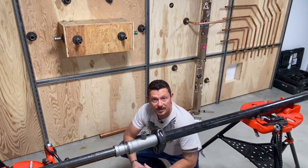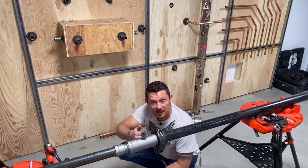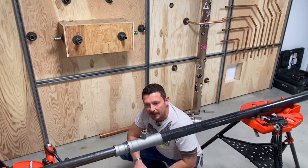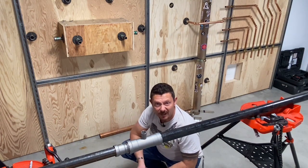You may have noticed that when I made that press, the pipe lifted up. That's because the fitting was moving towards the opening of the ring at the top, and it's pretty straight. We're going to put a camera on it later, but let's make the other presses using the push-pull or opposing side method.